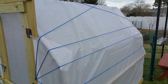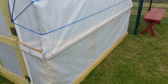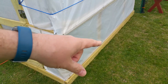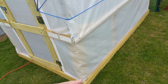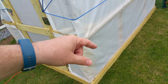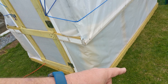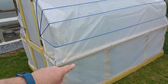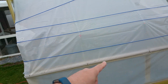That's the greenhouse — the clear plastic, which is not very clear, is a six-mil plastic. I plan on eventually cutting this plastic here so that this section all the way along can roll up on a piece of wood underneath, held in place with bungee cords coming down and under, so that this skirt here will be open but I can always roll the plastic back down. The tarp on the piece that goes over the top is attached on the side by these battens, held in by just four points or four screws.